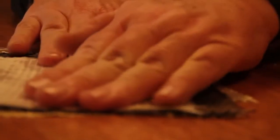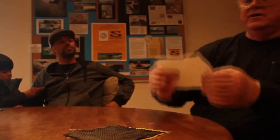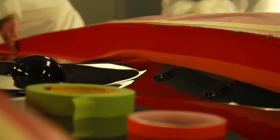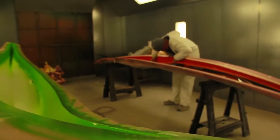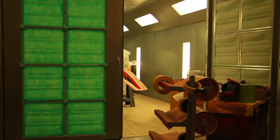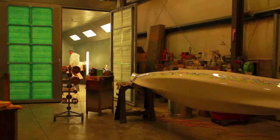And then down the impact zones in the bow and the stern, and also what the side seams are made out of, is going to be this 45-degree bias for the inside seams and structural reinforcement. When we go to a 45-degree bias on a stitch bond, you can see no light through it, and we have material going over like this, so there's double thread count coverage on everything. It's twice as strong. We'll infuse this whole package, and it will keep our resin ratios down really low, say 30 to 32%. We have a total here of about 54 ounces of fiber in this boat. We can anticipate a build weight of about 45 to 48 pounds at most. And that will give us a very lightweight, thin structure that's impact resistant and very tough.